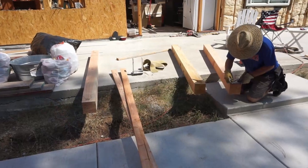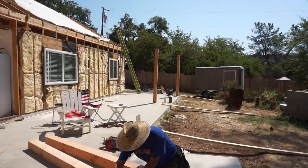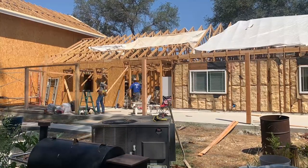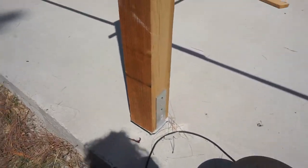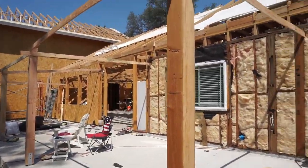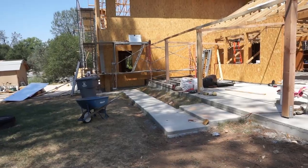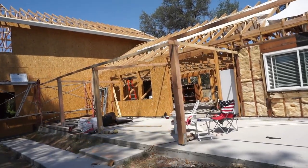Now we're moving on to the porch. My dad's marking and measuring up the posts — they'll get set into these post bases. You can see a couple posts down there. The beam is going to go right in that hole. Here's a quick time lapse of us setting those posts. Before we set the beams, we stabilize the posts with 1x. Those beams are stood up and gently fastened down, with 1x4s going between them. Believe it or not, it's just a few sticks and 1x4s, but it's really stiff. The next step is to set the 6x12 beams now that the 6x6 posts are in place.